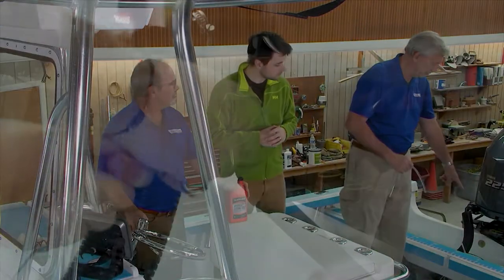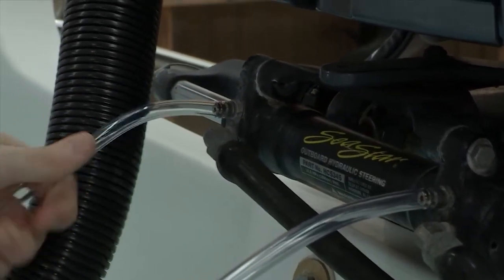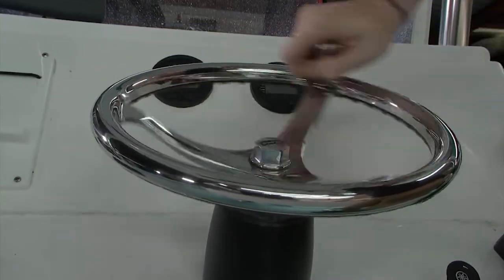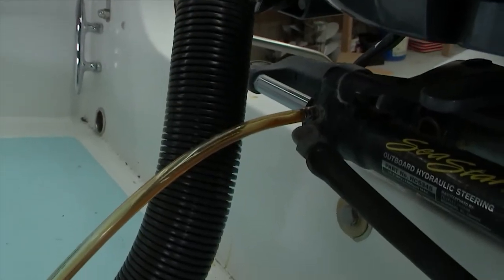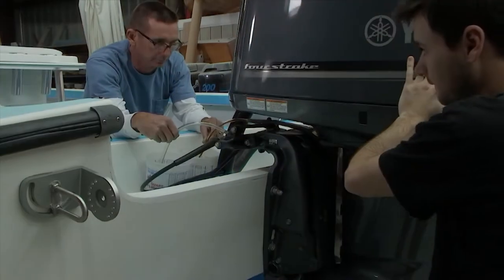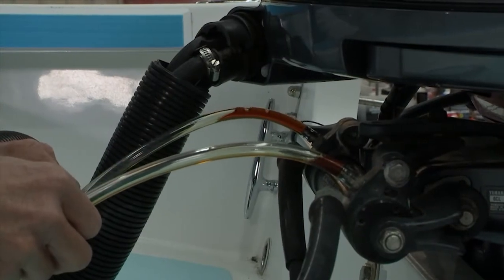To get the remaining oil out, there are two bleed ports on the cylinder. Get yourself two short pieces of plastic hose, put them on the bleed ports, and get a little catch basin. Open the bleed fittings on each side, then start to turn the wheel to port — keep running until you've pumped everything out. Turn the wheel to starboard, keep going until you pump everything out. Now you've got most of the oil out of the system. But you're not finished — you have to get the remaining oil out of the cylinder. Leave your bleed ports open, manually move the motor port and starboard back and forth. That will cause the cylinder to pump the rest of the bad oil out into the buckets.